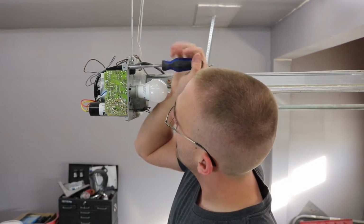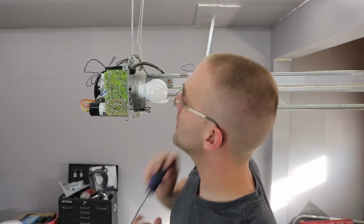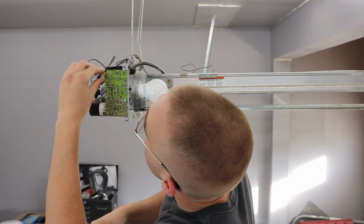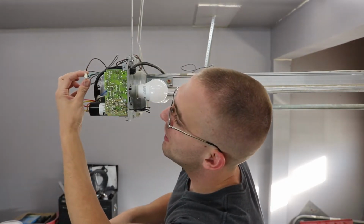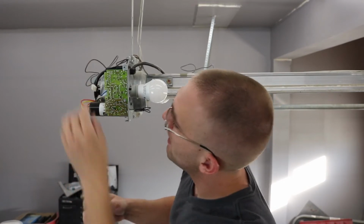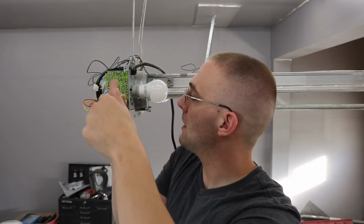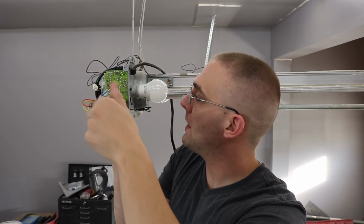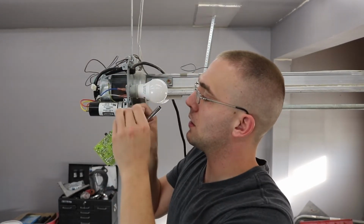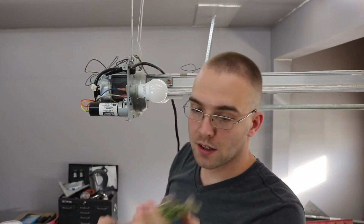But I will go ahead and take this screw out, or loosen it. So that's good. And there's one right here. Actually first I'm going to disconnect the plug and take note of where the wires are in relation to the board. The green one's on top. But then I'll go ahead and unscrew this. And the board I got should just directly replace this. Uncoil the antenna wire so you can get it out. And that's the old board.